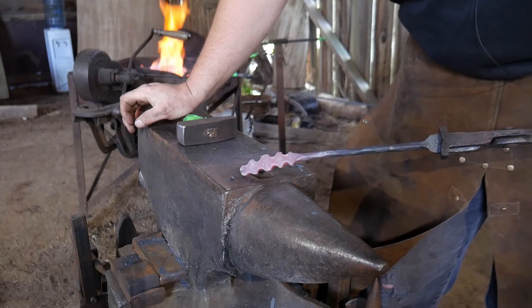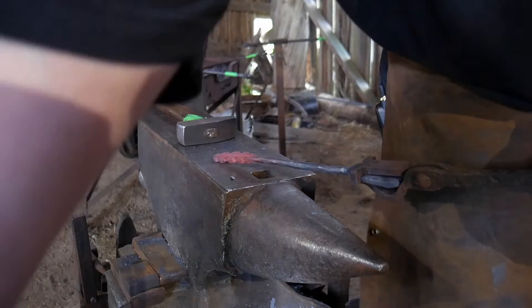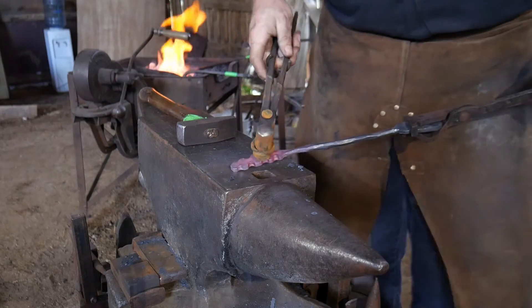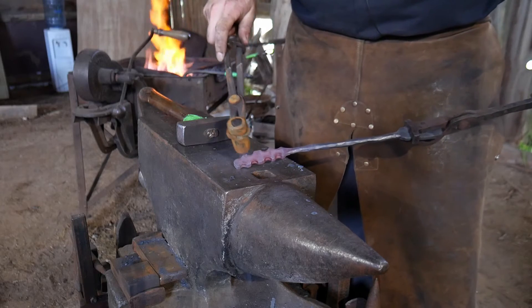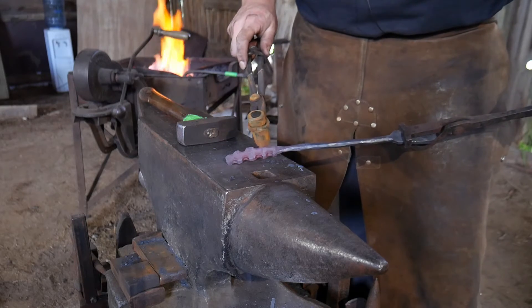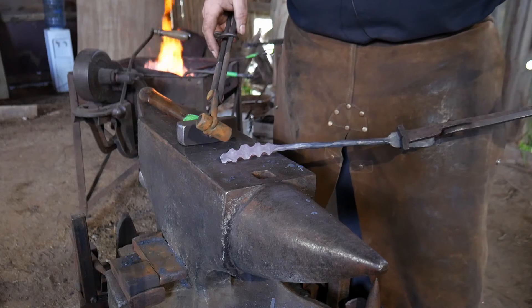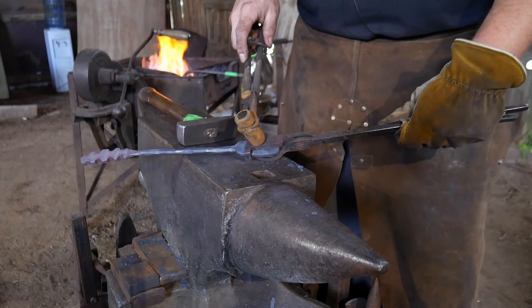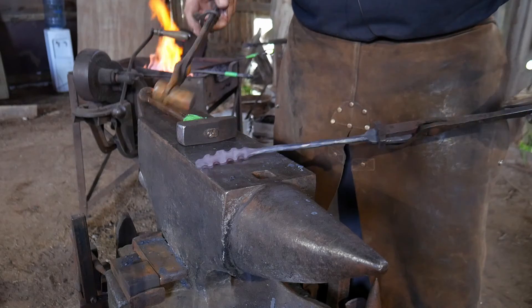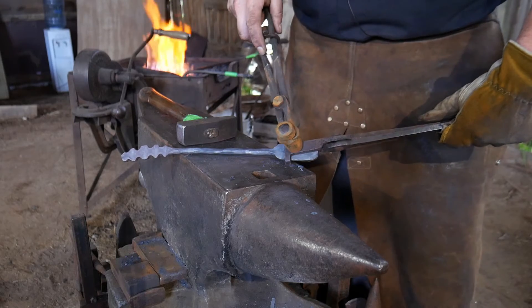So there's the preform for that. Now we will use a ball tool - a ball fuller or a ball peen hammer using a soft face hammer - and we're going to drive out these lobes. This will draw this material out into our oak leaf form. I'm not going to show this process on the other end - once you know how to do it on this side, it's wash, rinse, repeat on the other. But we'll go ahead and do this end for the sake of the video.